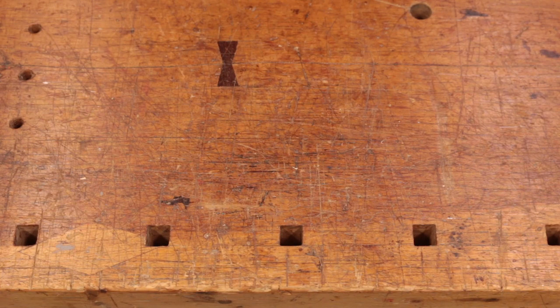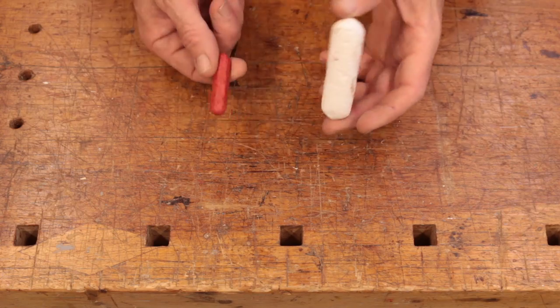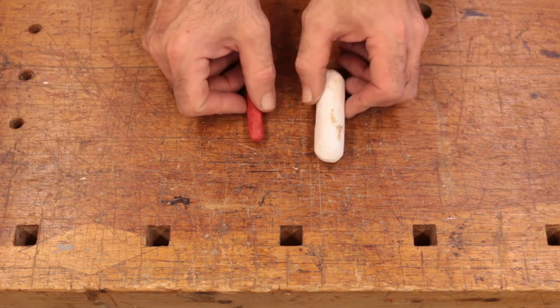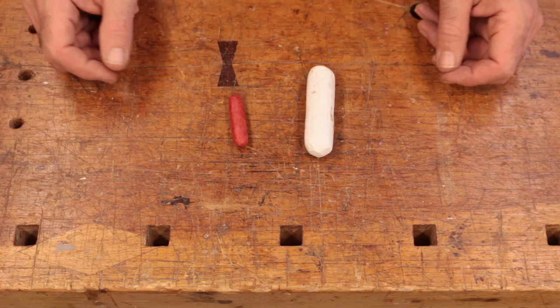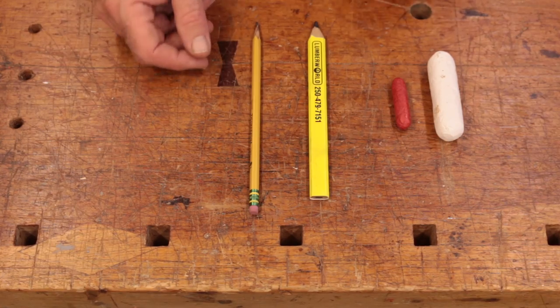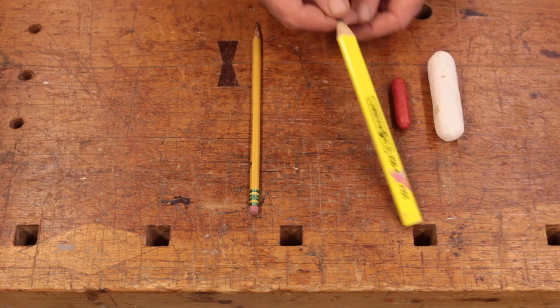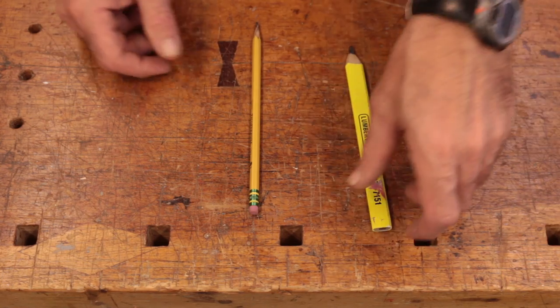Let's move on to the next important area: marking and measuring. Where marking and measuring is concerned, we have three levels of accuracy. At the rough end, you might want something like chalk or a carpenter's crayon — useful for very bold general markings, like where to rough cut a board, making notes on which plank needs to come out, which rib is rotten. Next are pencils. Your typical carpenter's pencil is fine for general stuff, but usually just a bit too bold for doing accurate work.